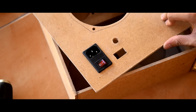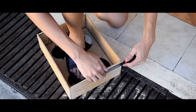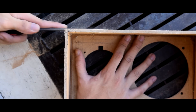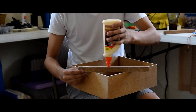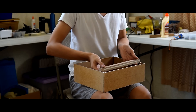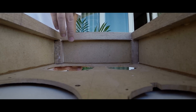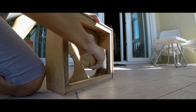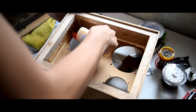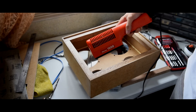If it fits, you can now mount them in place. You can use your metal file to plane out the edges. I cut segments of 1x1 wood and used them to brace my enclosure. Wooden braces are used to make the enclosure rigid, thus making it much sturdier. And by the way, this will also help reduce the vibrations of the enclosure. As a final reinforcement, you can glue and seal the edges with wood glue. If you want to make the drying process much faster, you can accelerate it by using a hairdryer.